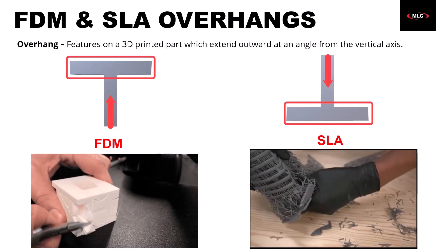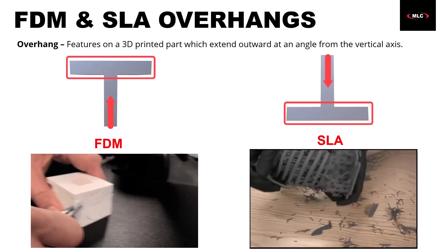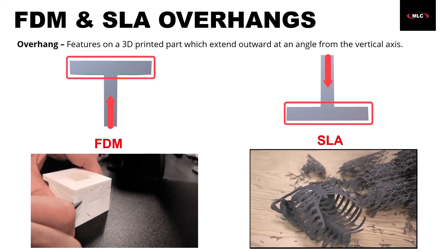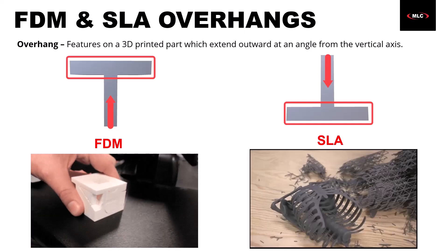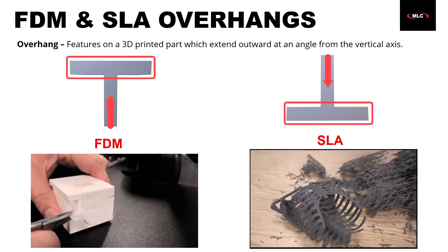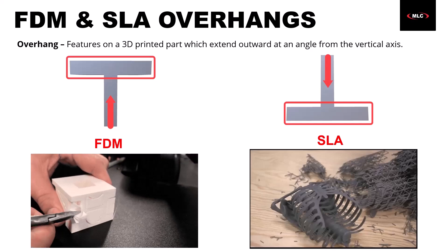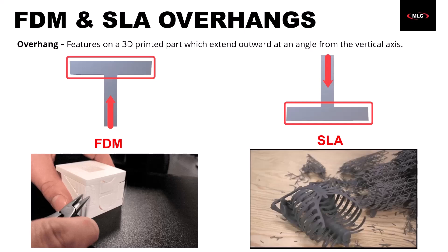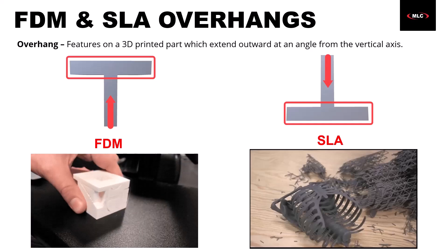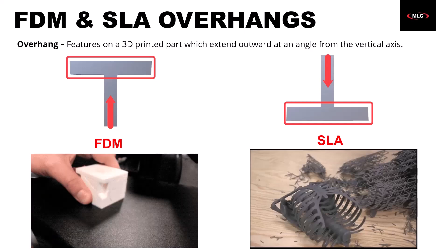There may be some post-processing needed for supported surfaces. In addition to that, overhangs make it so that the upper Z direction of your print volume becomes less useful, because you're only really using it if you're printing super tall or really big parts. You can cover the entire build plate in multiple parts through the X and Y plane, but realistically you're not going to stack parts above other parts because then everything is covered in supports. And that is really one of the biggest benefits of SLS printing.